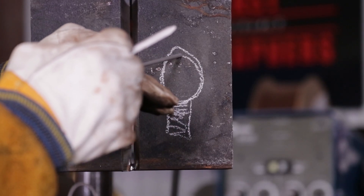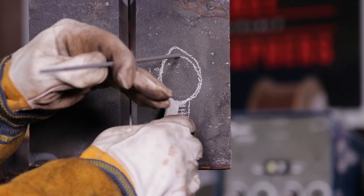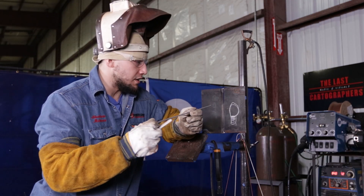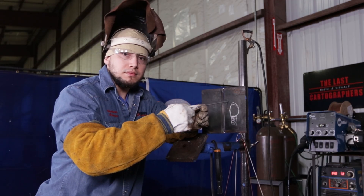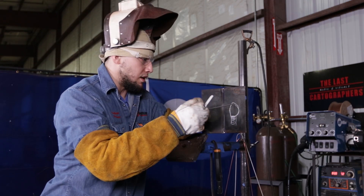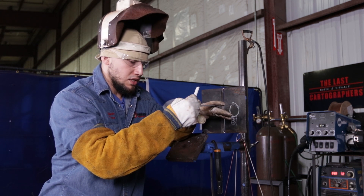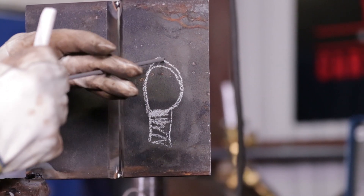When you push on top of that keyhole right here, you can actually see this puddle right here turn from bright red to dark. Because I'm pretty much treating this rod like a cigarette — like turning off a cigarette. I'm controlling the output of the heat by choking the rod. So as I go up, I push in, I choke the rod, so I stop heat from coming out of the rod. And that makes this puddle down here cool off. When I see it turn from bright to dark red, I go back to it. And that's my method.